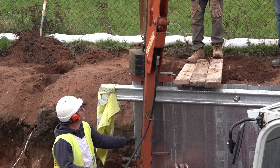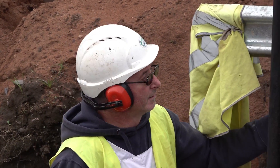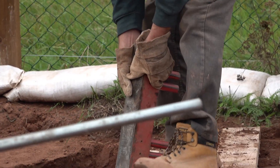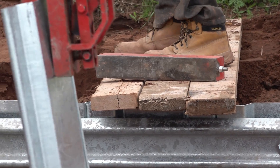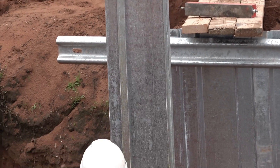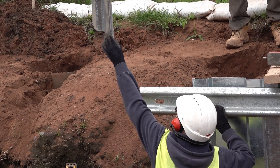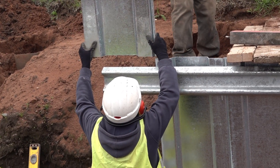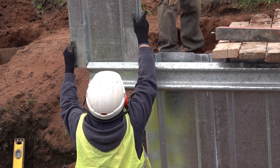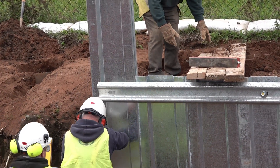This attachment here, which is attached onto the Wiedermann, is basically a post-hole driver from farming. All it does is drive posts in the ground. We've adapted it slightly to go on. You'll notice there's a mechanism there which is a quick release. You'll see the quick release is at the top, so somebody doesn't have to climb a ladder to the top of the pile. You've got to just keep your fingers out and make sure the line of the piles is absolutely right. That's the quick release mechanism.